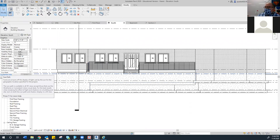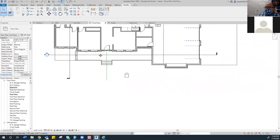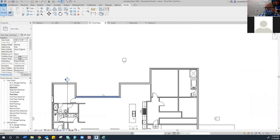If you're doing the back of this, you can do a porch here. Or in the back, you can do a patio, which would just be a concrete slab on the finished grade, okay? Now, keep in mind that your topography is also there. So if you're doing your concrete pad, raise the concrete pad up, offset it up off the base by like 2 inches. Then you won't have the overlapping issue. And that would just be a concrete pad in the back. If you want to do a porch, you can do a porch, okay?